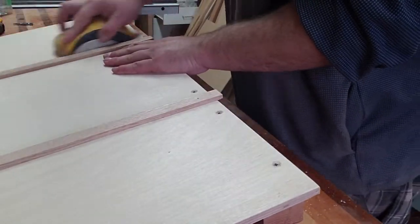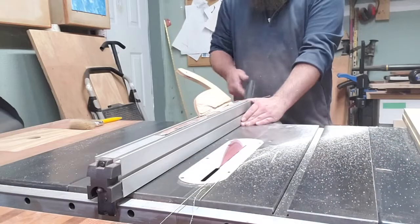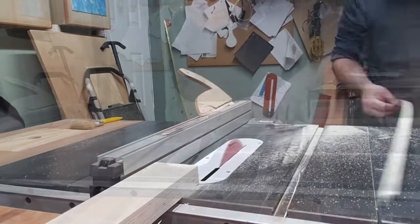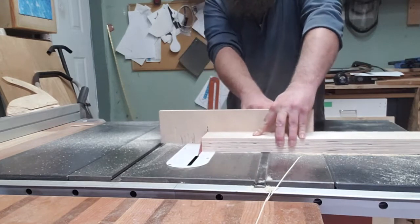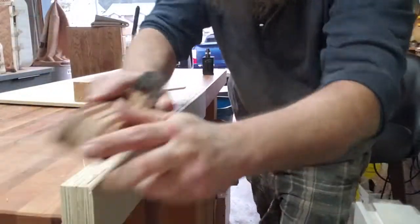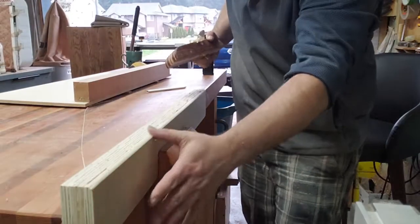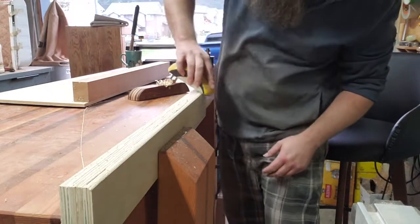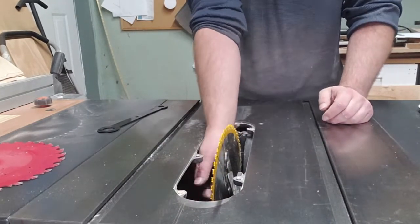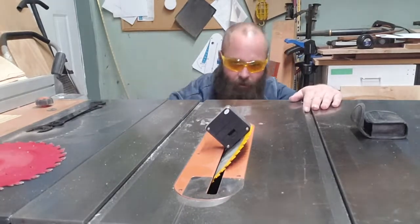That would be the fence on the far side of you when you're pushing it through the saw. Then we true up the fence that's going to matter — the one that's closest to you when you're pushing it through. When I glued the plywood together, I made sure one of the edges was exposed in the glue-up so it would ride nice and clean along the fence when truing it up. Cut it to length, and gave it a little chamfer on the bottom corner so the sawdust has a place to go — that's the inside face of the sled. Then I put my full kerf crosscut blade in the saw, because that's the one I'm going to be using to make miters, and tilted it to 45 degrees.